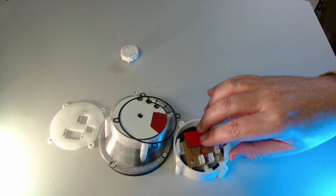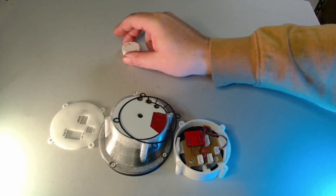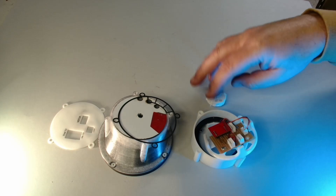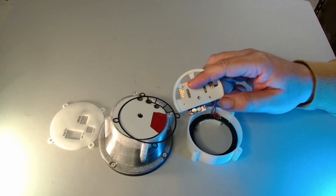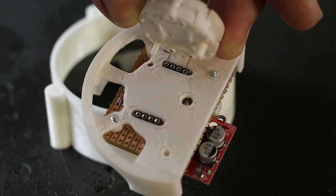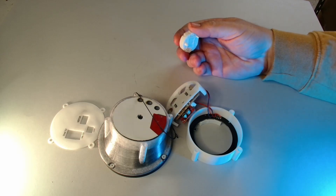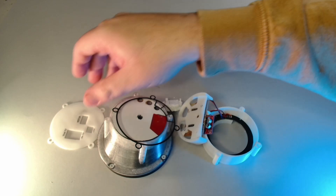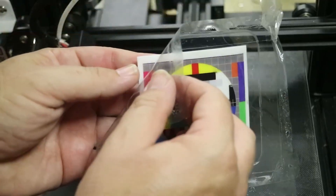The driver board's all incorporated in it because I just want to keep the wiring nice and tidy, and the plugs can go in as well. You don't have to use plugs, but if you're swapping things around all the time it's just so much easier. Before we put that on we'll have to put the motor in obviously, because the motor will go through the hole there for the needle. Just inside here — just to make life easier — the pitch of these pins on the motor matches regular circuit boards. So these are just IC socket pins which I put in there so I can pull the motor in and out as I please. Then it all goes together and we chuck on the back piece, which has writing on it via toner transfer. If you want to know how to put toner prints straight onto your 3D prints, check out the linked video.